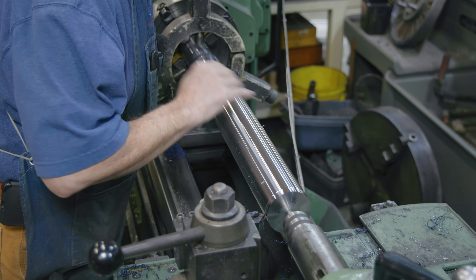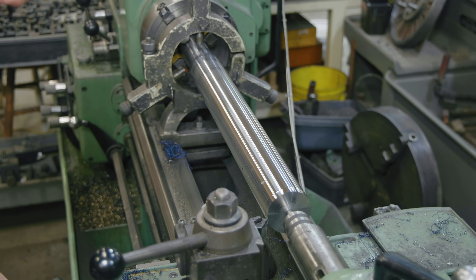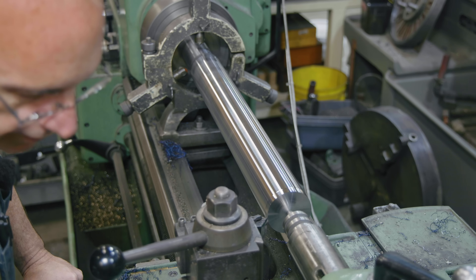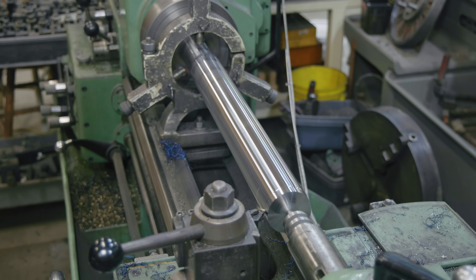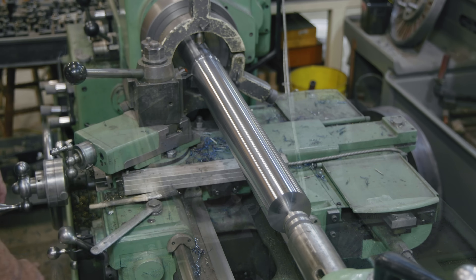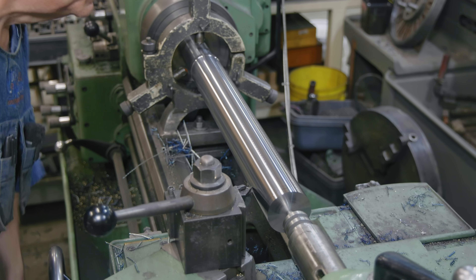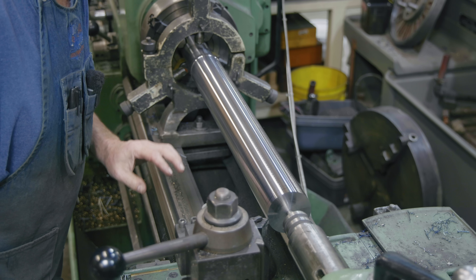That's excellent. That insert seems to be the one we need to be using. I'm going to dial in 50 thousandths this time and try that out. That appears to be turning pretty nice as well. The chips are breaking good. I'm going to put my little plexiglass shield right here to keep the chips from flying back on me — it does a really nice job of keeping chips from flying up in your face. While I have that set, I want to go ahead and get a measurement. We're reading 2.947 inches diameter.